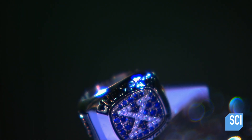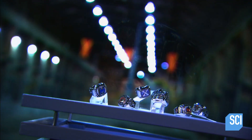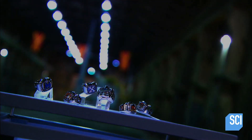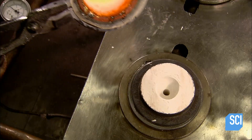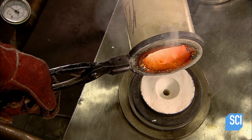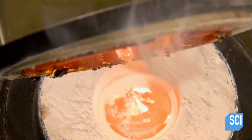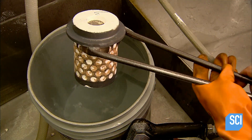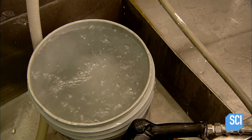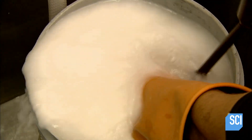The technique of using a wax model to create a mold is known as the lost wax process. This company uses the plaster shell as a mold to cast rings in three types of metal: gold, sterling silver, and stainless steel. In just minutes the induction furnace has heated the metal — in this case gold — to the required molten state. They carefully pour it into the plaster shell; gold flows down channels and into the cavities left when the wax burnt out. Once the gold cools and solidifies, they submerge the shell in cool water, which instantly dissolves the hot plaster, releasing the cast piece.